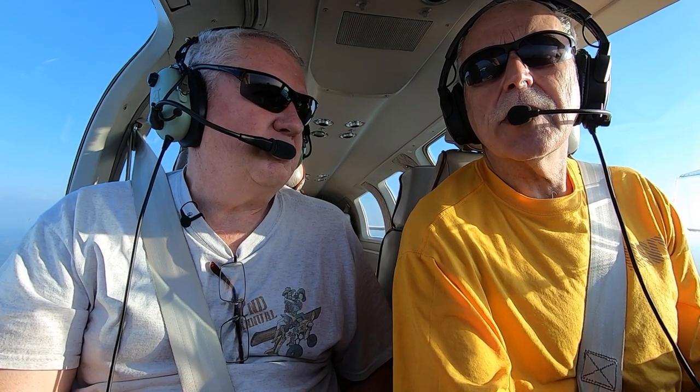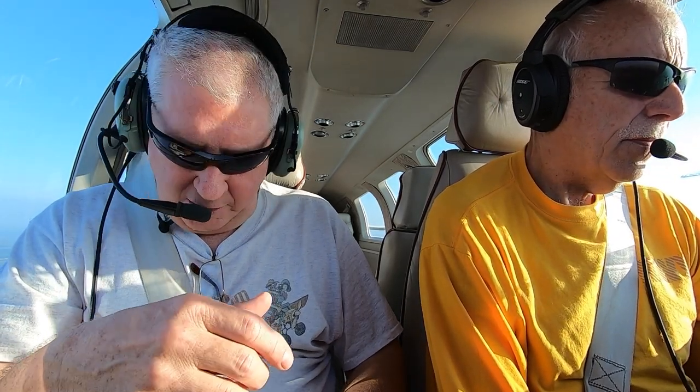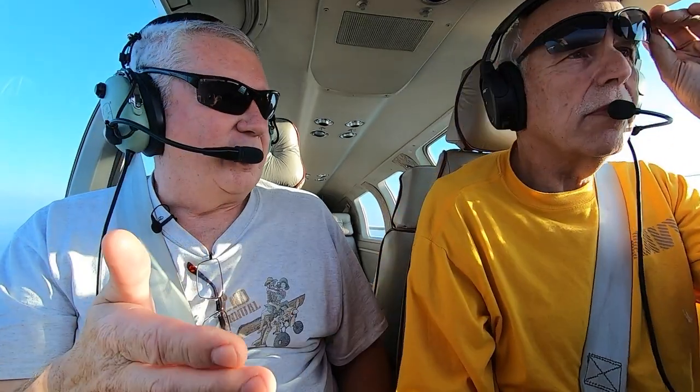And you don't have vertical speed. No, that's not an option. That's a $13,000 addition. The one number I saw was $2,600, and that's to activate both the altitude preselect and the vertical speed. But since your autopilot doesn't have that, what I'm saying is that it's a function of the KFC-200. It's not a function of the G500. Okay. The KFC-200 is an analog autopilot, and it doesn't have that. It needs an extra brain to do that, an extra box.